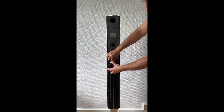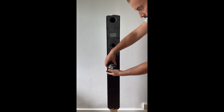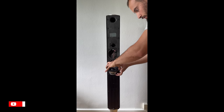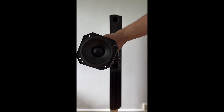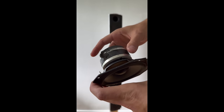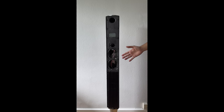Next step will be the lower woofer. We have finally removed the screws around the lower woofer. Remove the cables and the secondary cable underneath. Here we go — this is the lower woofer, and also very bad isolation material. I would recommend taking a vacuum cleaner to clean the rotten foam in this area, just to prevent the rotten foam from falling onto your carpet or floor. My fingers are already very messy.